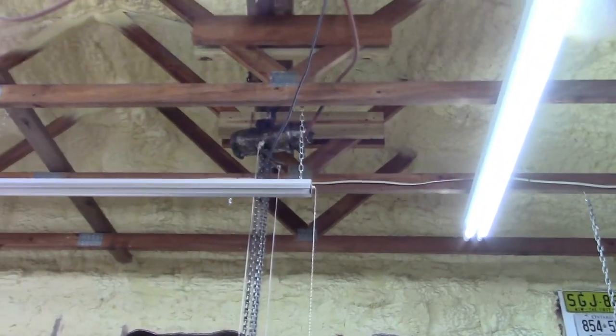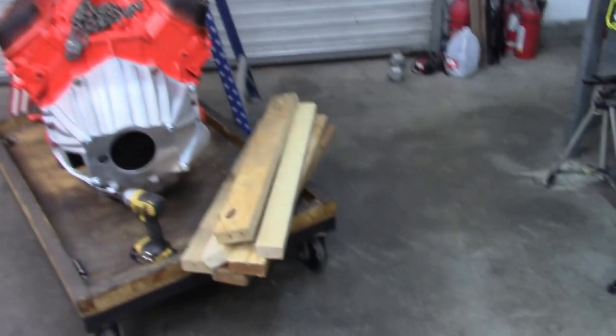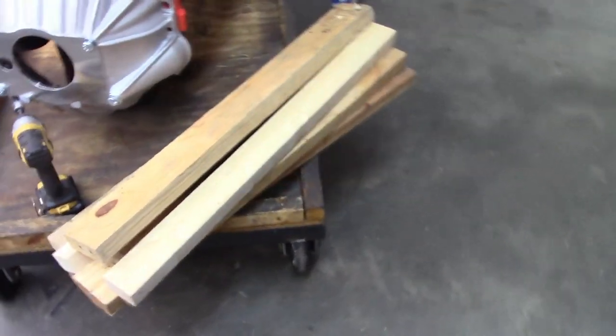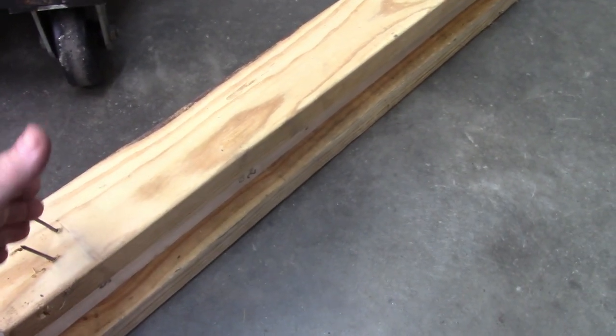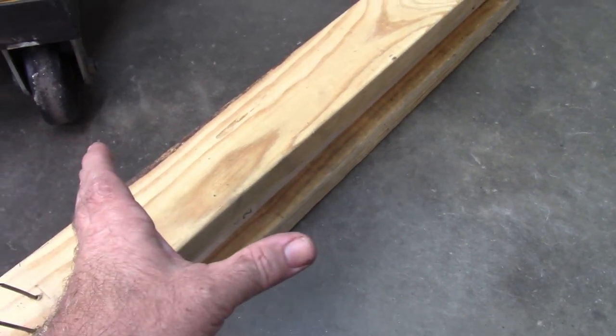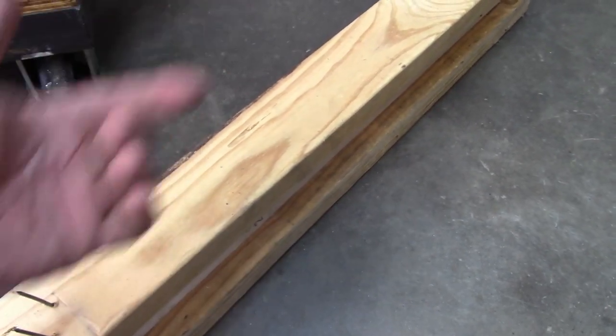So what I want to do is support those two trusses. What I plan to do is make two I-beams. I'm going to take a two by four, a two by three, put it inside of it, and then put another two by four on top, and screw all that together — so I end up with basically an I-beam. Then I want to put this against the bottom of the two trusses. They're on a two foot distance between them, so this is like 32 inches — plenty of length there.